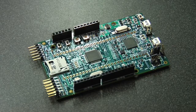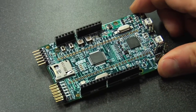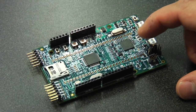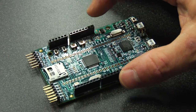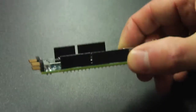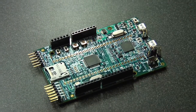I'd like to show you a demo using the IO handler. What we have here is our LPCExpresso board which has the LPC11U37H along with our LPCLink2 debugger. On the board we also have the connectors for Embed and Arduino, and on the underside we have the LPCExpresso connector which allows you to plug the board into your own application and start debugging.